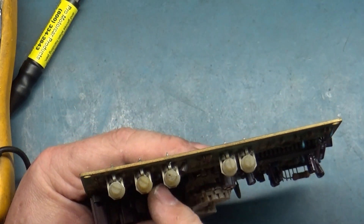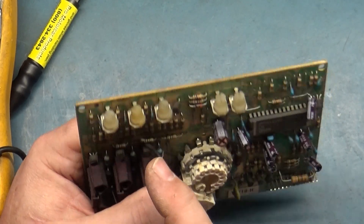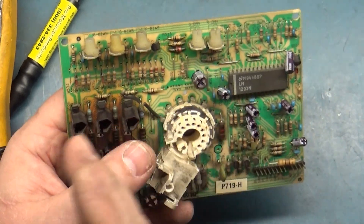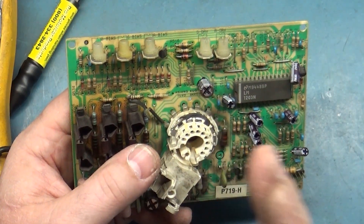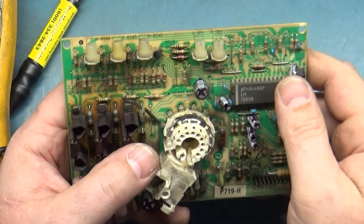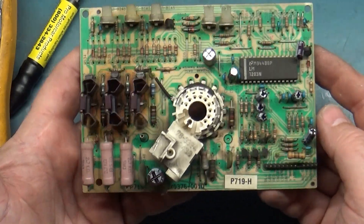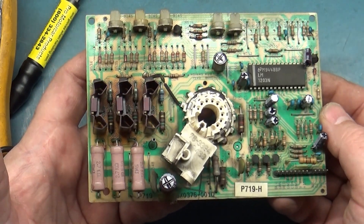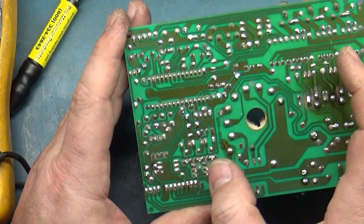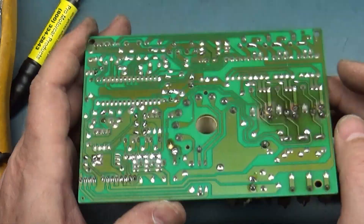There we have a nice new-looking neckboard. I got all of the pots wiped back and forth and set them to about 25%. The cutoffs and drives — the drives can be about halfway, but all of the bias pots you want at about 25%. Some of these like to be about 50%, but across the board — the 7400, 7500, 2000, 5000 — they all like to be about 25%. Anything higher and the colors tend to bleed, especially as the tube gets older. So I set all these to 25% as a baseline, and we can go from there. A nice rebuilt, good-looking neckboard. The back side has been reflowed on the header pins for the interconnect cable and anything else that needed it, and of course we just repaired the transistors.